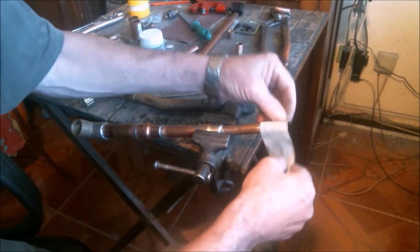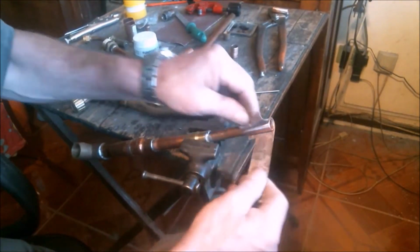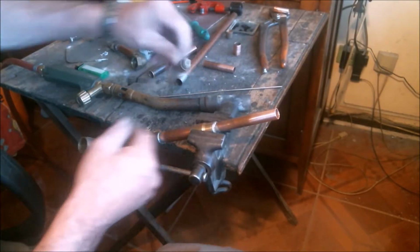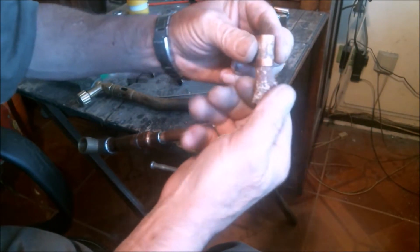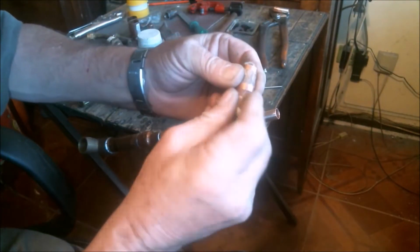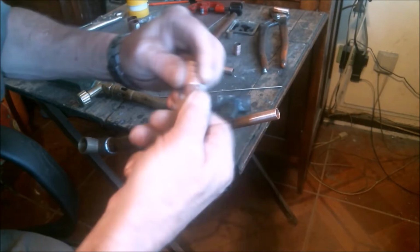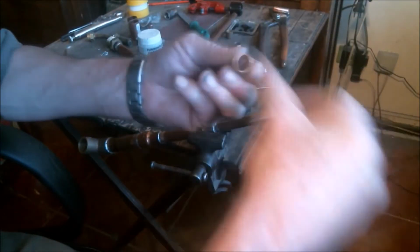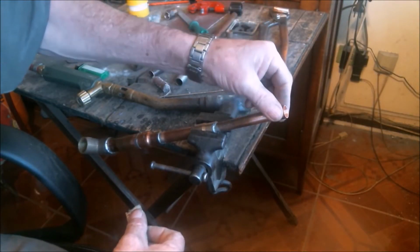There are some tips I can give you to avoid exposing the flux to excess heat and reducing the length of the process. We must prepare the parts very well, cleaning the fitting and the pipe. And we must avoid leaving our greasy fingerprints on the metal. A good braze needs a uniform temperature and a fast process all over.